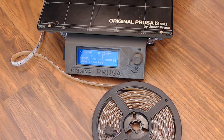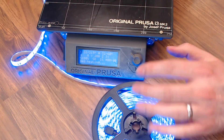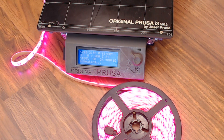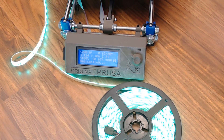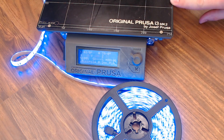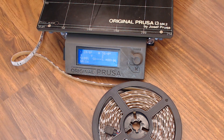Let's try it out with our new start and end G-code. I've loaded up the print — let's print from SD. Print starts, we're blue. The bed is heating, the hot end is heating. The bed's up to temp — we're at our pink-violet color. The extruder's up to temp, so we're at our red color. We're going to home and level. The print has started, so now we go to the white color. The print is complete, so we raise the Z and went to our green color. Now we're waiting for the bed to cool down to 35. Bed's cooled down, we moved the Y position, and now we're on blue. We're in our G4 command waiting, and now the LEDs are off.